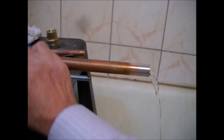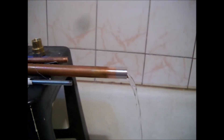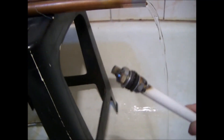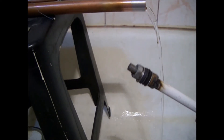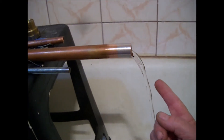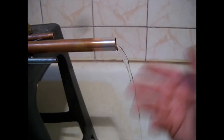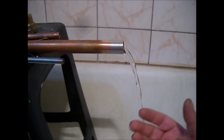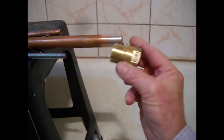With bread or cooked potato we can make permanent repairs, because the bread or potato is dragged throughout the pipes and removed through a faucet. The advantage of the bypass, water blocker, and even the self-boring valve is they can be used for repairs even with a strong flow of water. Bread or cooked potato won't hold long enough before you are able to solder. So in these cases our only option is using these mechanical tools, but we can only solder a threaded joint.